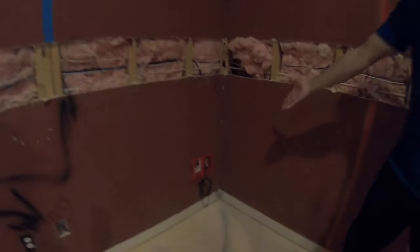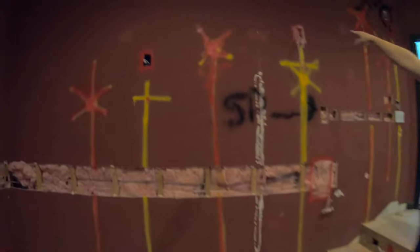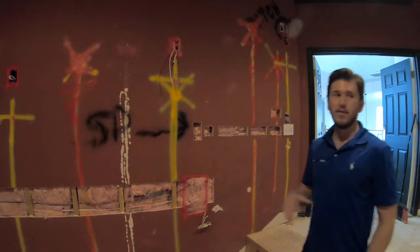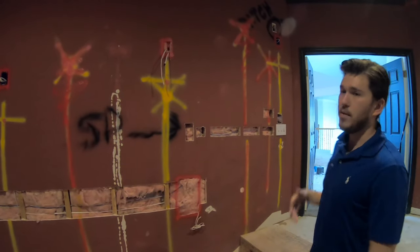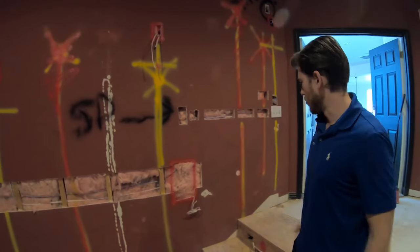Over here for our front right and our subwoofer we're putting power right there because we want to make sure there are no wires showing. We have RG6 coax in place to make our way around the room. You can see all of these red holes — we ran Romex to those and we're going to tie that into an independent network-enabled switch, so through the universal remote the customer will have the ability to control all of these sconces. We're going to have construction put in pillars to give a really nice visual appearance to the room.